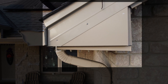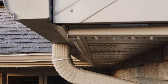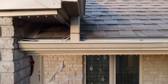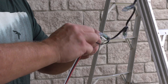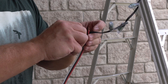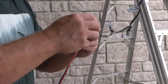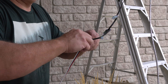For the most part, the install was pretty straightforward. The corners were a bit challenging — I did a better job on some than on others. If you look at them closely they aren't pretty, but from any distance they are just fine. The track was continuous until I needed to transition from the soffit to the small peak. One of the benefits of these lights is that I could just cut the wire between the lights and splice in an extension. To do this I made my own waterproof connectors — or at least I hope they will be. I squeezed some dielectric grease into a regular wire nut and used that for the connections. The connections are protected from the weather inside the track, so I believe the grease should protect them from the elements.